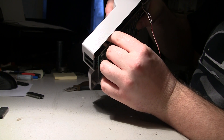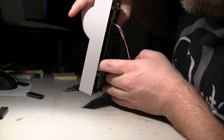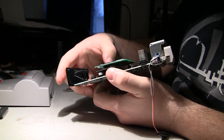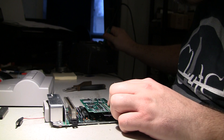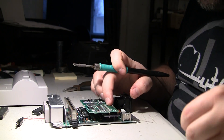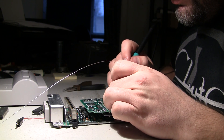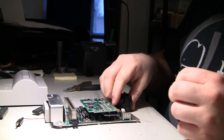One of the main concerns was - I might actually be hitting that screw. I might have to mock it down, at least with one solder pad here, just because I think I might actually be hitting that screw. Not a big deal if I am - I'll just use shorter header pins.